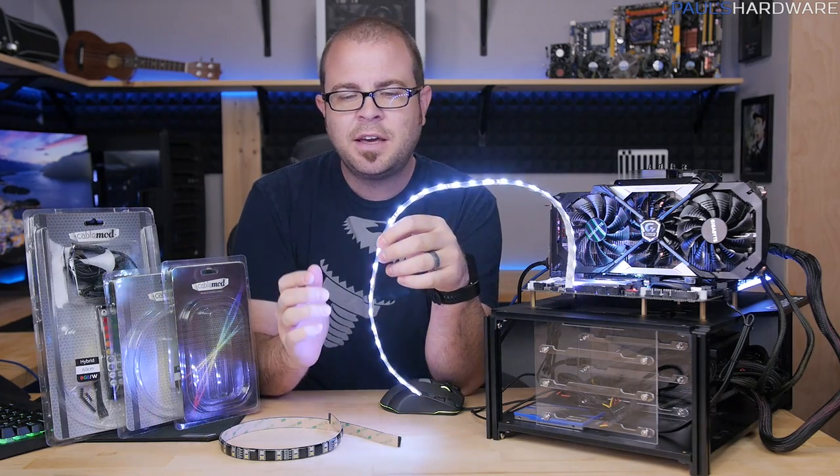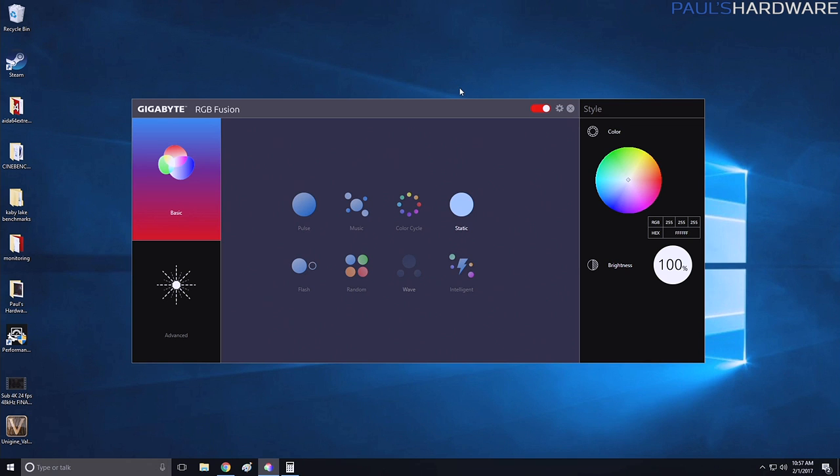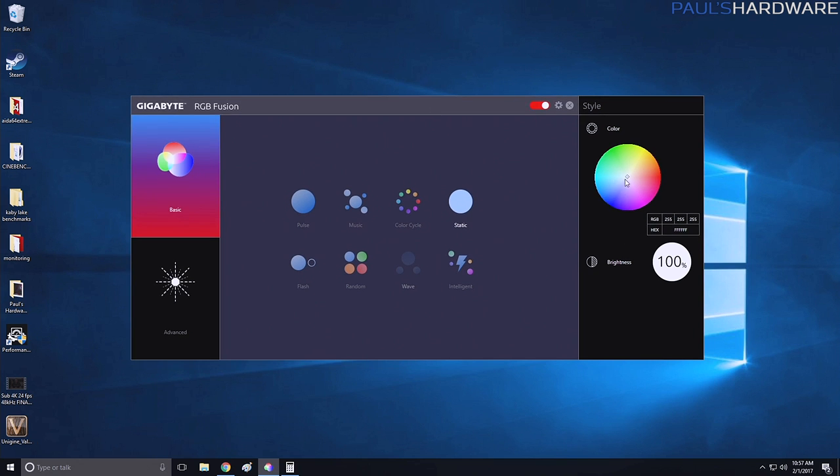You have 256 levels of brightness from 0 to 255, because computers primarily communicate via bytes — a byte is 8 bits. If you've ever adjusted color using a computer, you might have seen something like the color wheel Gigabyte provides in the RGB Fusion software. The color wheel lets you visually choose a color, but if you look at the RGB numbers you'll notice there's a value from 0 to 255 on each one — 256 different values. By providing different brightness levels to the red, green, and blue outputs, those diodes will be brighter or darker, and combining them gives you the final color. All blue is 0, 0, 255; all red is 255, 0, 0; all green is 0, 255, 0.